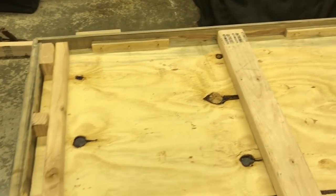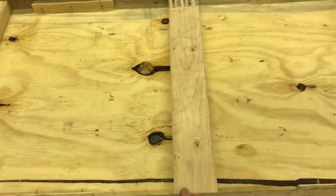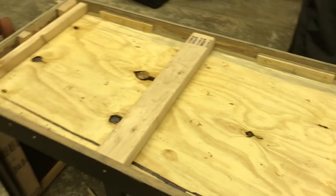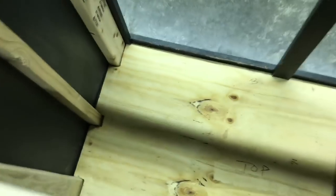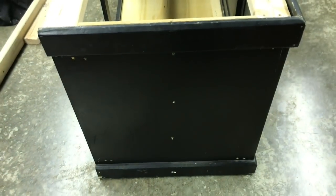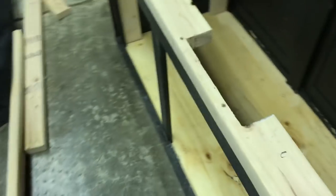Check it out — the bottom is in. We've got cross braces here, here, and here, and these four pieces so it's got something to rest on. The plywood on the bottom is looking awesome and it's super sturdy. All of the screws are countersunk on the whole stand, so we're gonna be putting some caulk or spackling on that and then sanding it once it dries.